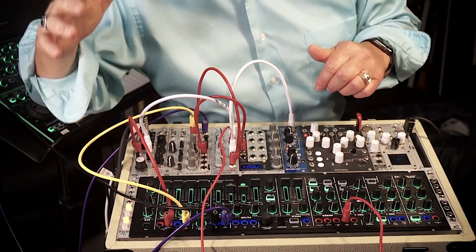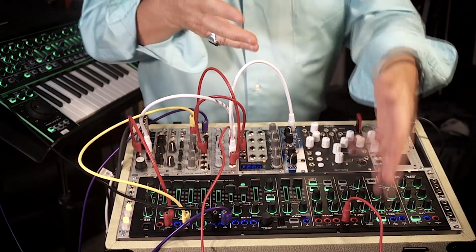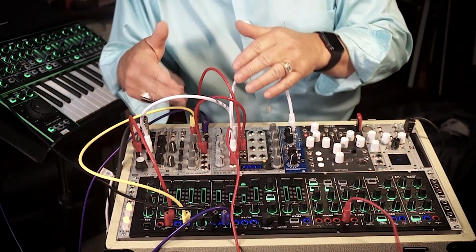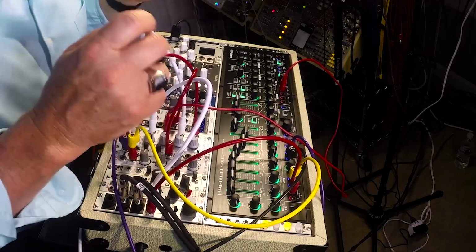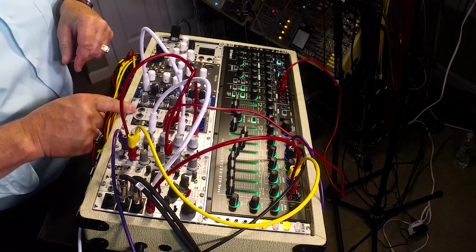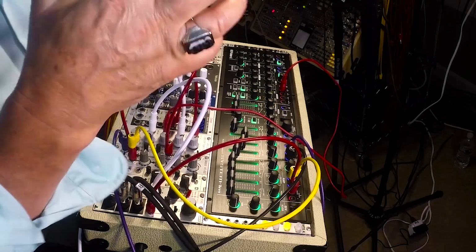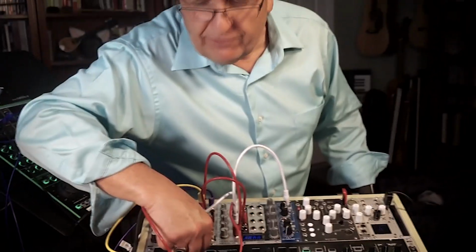Hear this little skipping sound? That's not possible with the SYSTEM-1. But wait, it is. It's the SYSTEM-1 as my source. I'm playing with envelopes. I'm now using this envelope generator whose release time is being voltage controlled by this oscillator 2 times a second. It's changing the release, opening it, closing it, sort of making a stutter effect. And that has now replaced the SYSTEM-1's envelope.